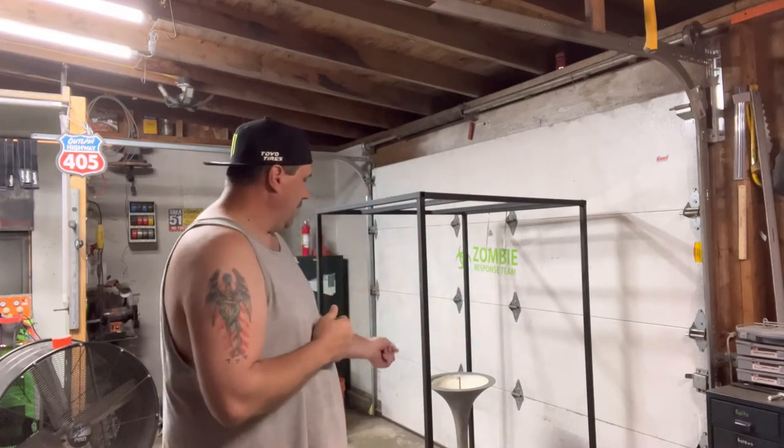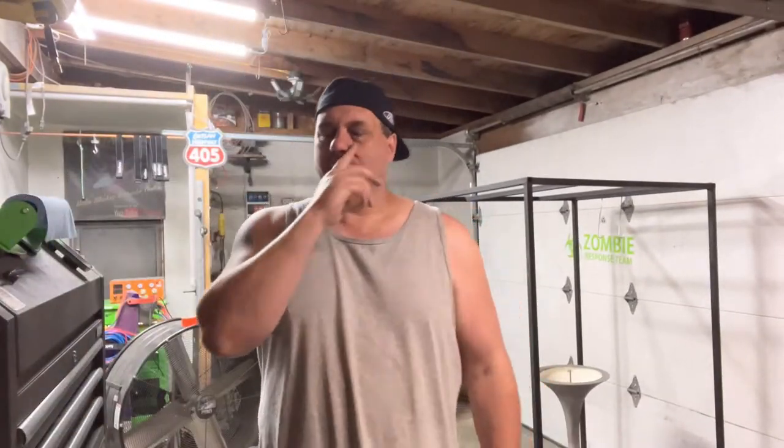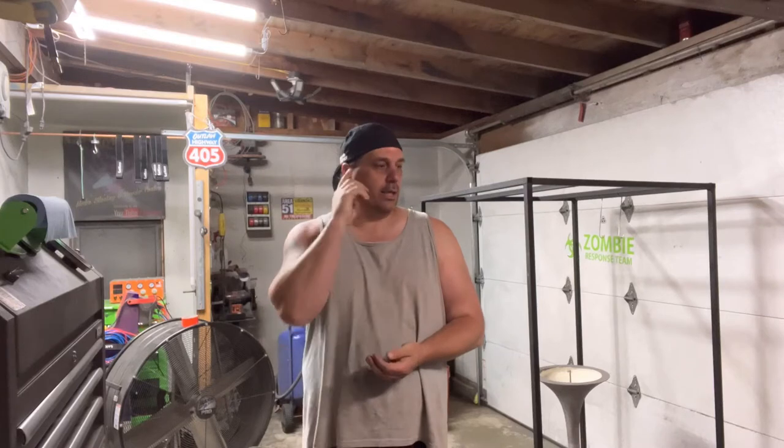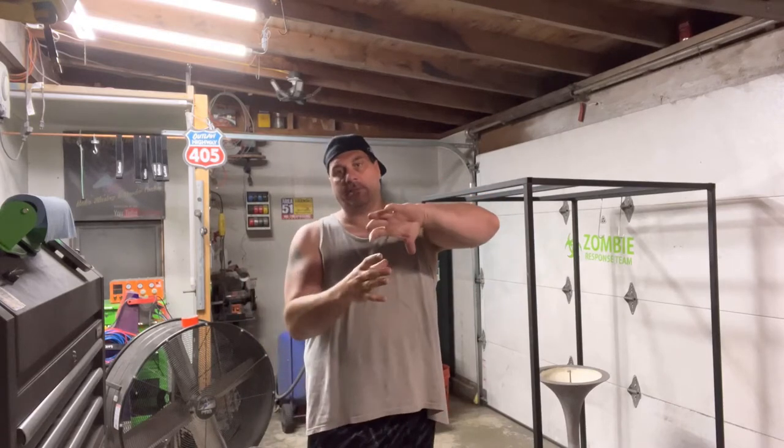Welcome to the channel. Today we're doing what I think is called a Knoll base — it's kind of an art deco base. When we were blasting it, we noticed there was filler on it, and we can't put filler in the oven, so we're going to use lab metal. We talked to the customer and he said it's fine to fill it, because they have some deep gouges and it looks like two pieces were put together with some kind of seal.